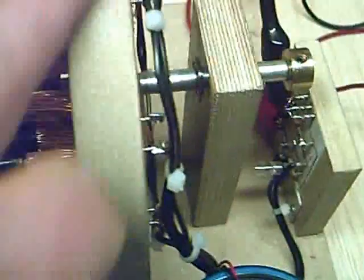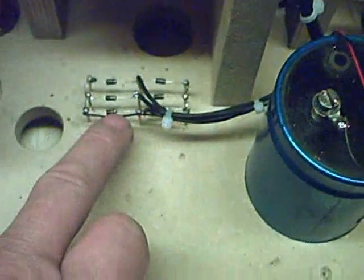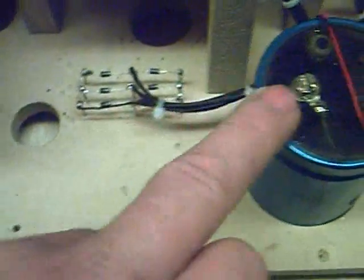That's the generator — three-phase, four-pole generator — which just goes through the diode bridge and into the capacitor. On the end we've got another one. This is one I built just to test this up. It was just easier trying to bolt it on off the end of that one, but it was hard on that big one to keep messing about with it.